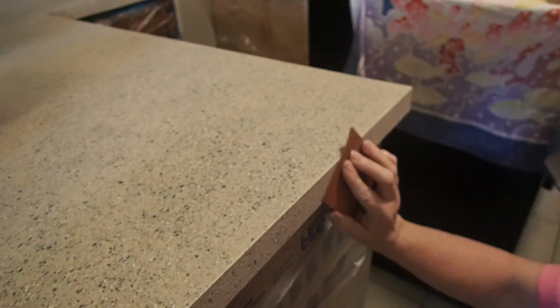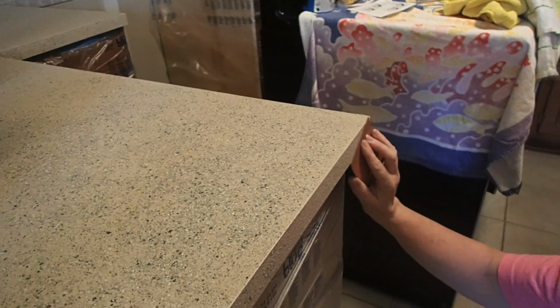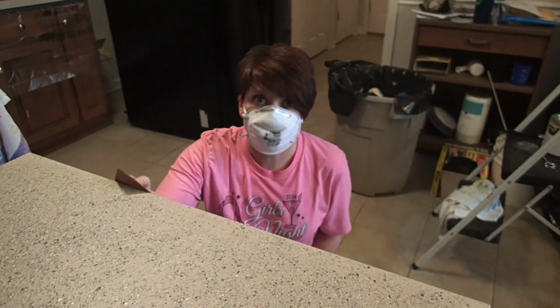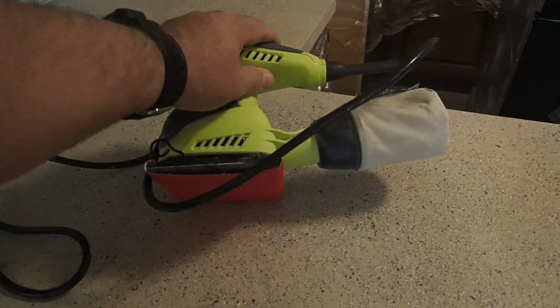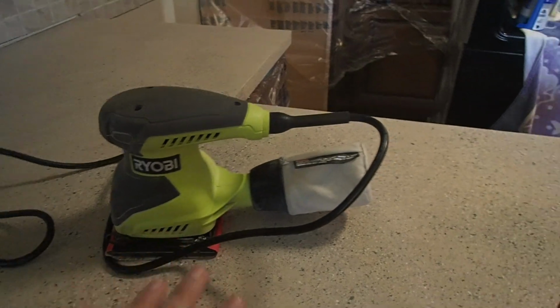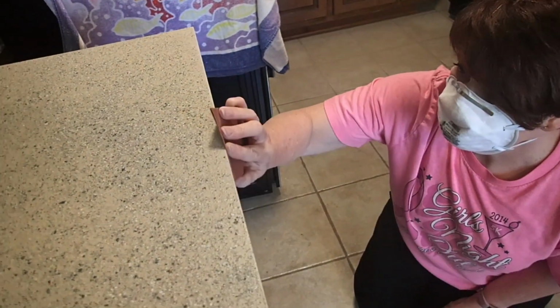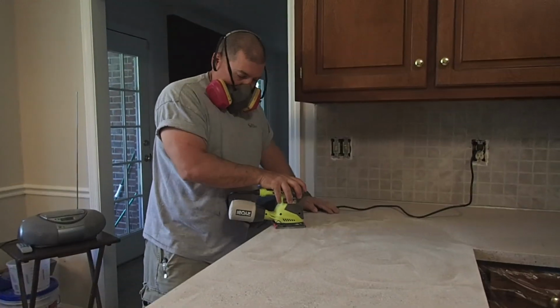You're supposed to come back after all this is set for 24 hours and sand in a circular motion. Now, of course, they recommend a mask. You see, Angie's got the mask on. I'm going to be lazy and do it with a sander, it's got to be oscillating. They want circular motion, so that's what I'll be doing with the sander. She's going to do the fine stuff on the edges, and we'll show you after this step.